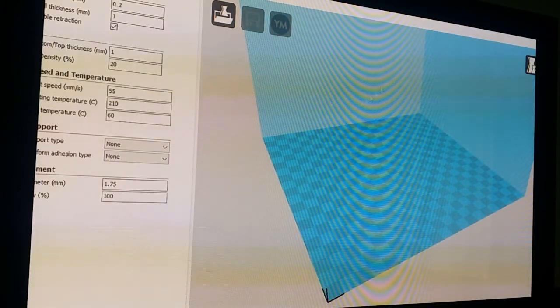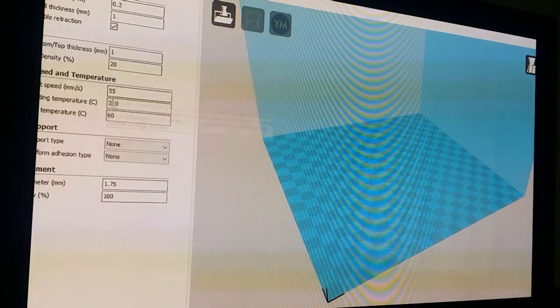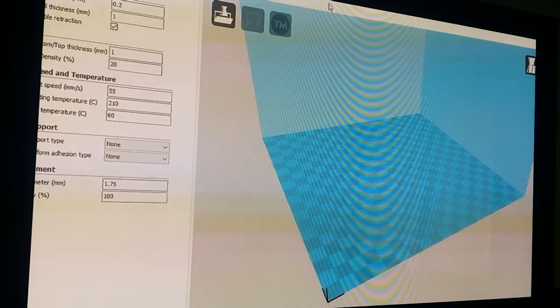There are different ones, and it keeps all of the settings for your printer and all of your speed settings, temperature settings, and stuff like that. You have to set that in your slicing program. As I said, this one's Cura, C-U-R-A. And when you get your 3D printer, it'll come with a CD. That CD will have drivers on it and stuff like that, and it should have Cura on it. And in there will be an INI file with all the Cura saved settings.